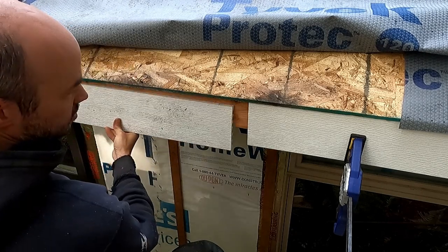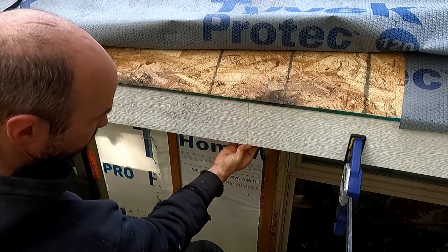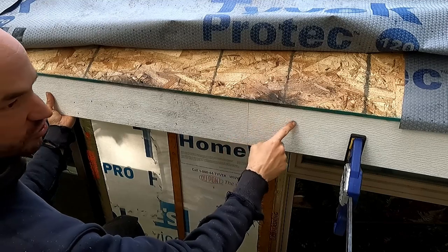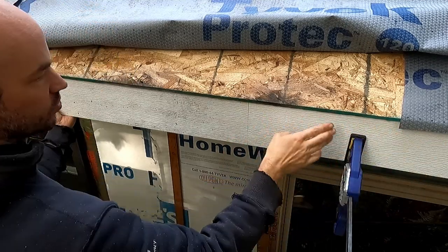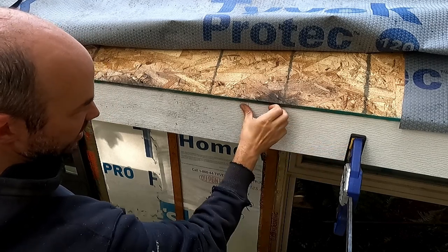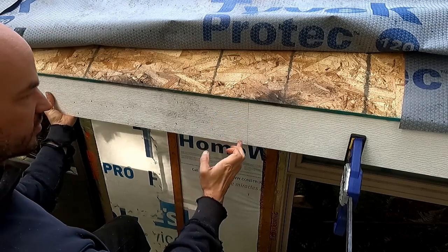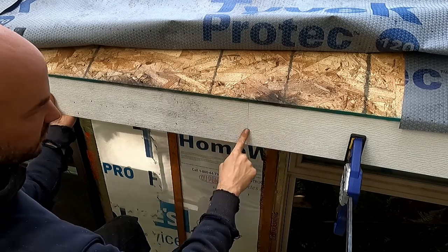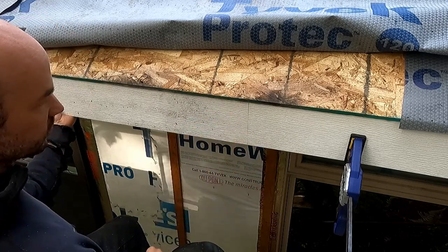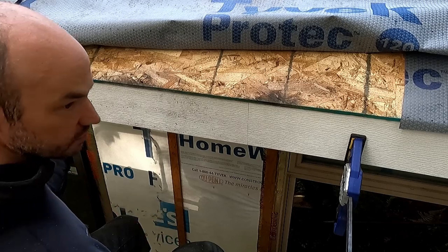To carry on, it's pretty simple. Dry fit the butt joint — very little prep to do. I cut the ends nice and square, dry fit it, make sure I'm happy with the gap. This stuff is super bendy, so when I screwed down this piece I didn't screw the last couple of courses. When I dry fit it there was a little gap at the top, so I was able to flex it down about an eighth of an inch and clamp it. Now when I fit this piece in I get a good tight seam. Since the ends are square, I do what I need to do to get them to mate well without a chevron or anything weird in the joint. From here it's really simple — slather on some more goop, butt these up, flush up the surface, clamp it, let it dry, then go back through and carry on the screwing.